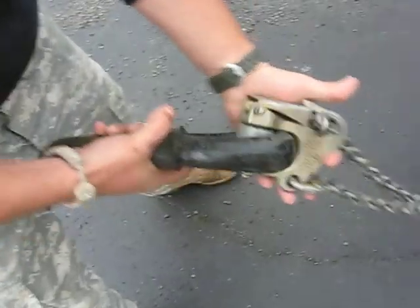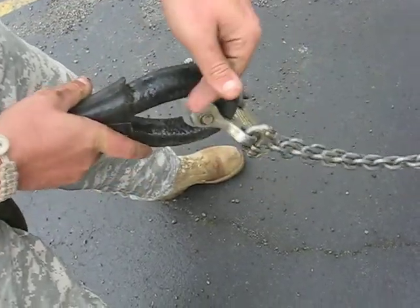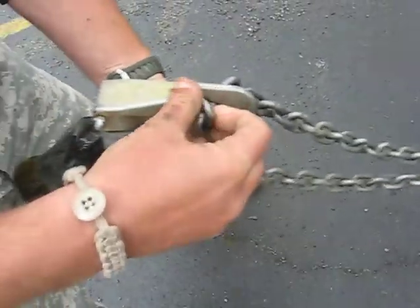You're going to drop it, come up to your lifting leg, and come to your grab hook assembly. You're going to make sure that it's not inverted. The roller portion is on the inside of the potted eye, and the chains aren't routed through the potted eye. You're going to check your length — count of three.